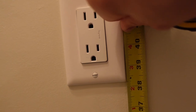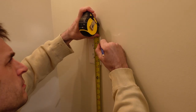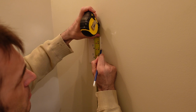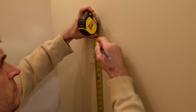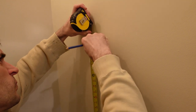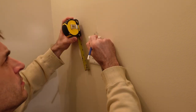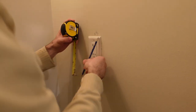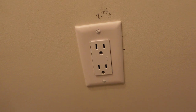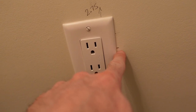The bottom of the outlet cover is going to be in contact with the sink, which is not good. So I'm going to go up 2.75 inches, bringing the bottom of the outlet cover to 41 inches on the wall. I was going to bring it one inch higher but backed it down a little bit.